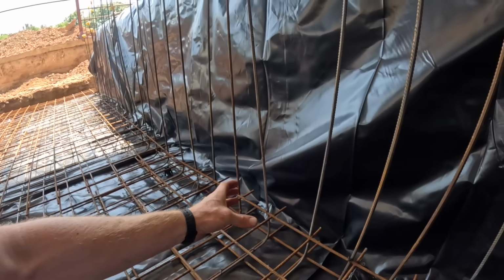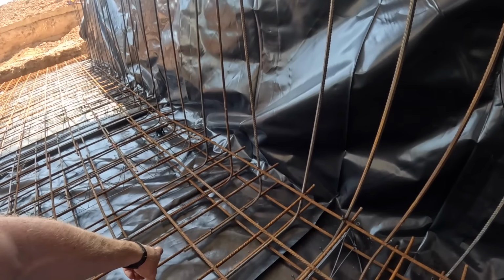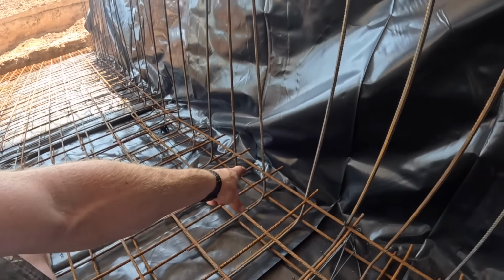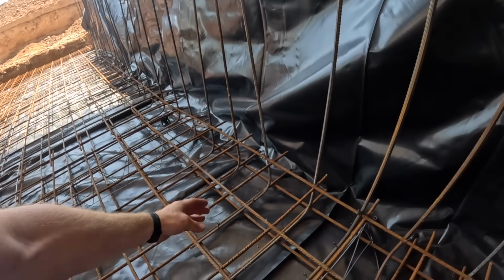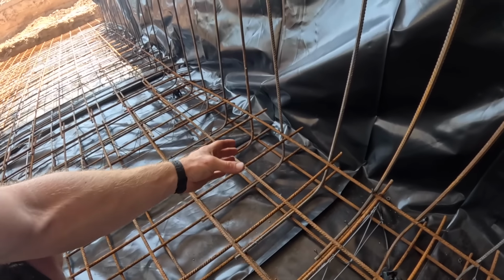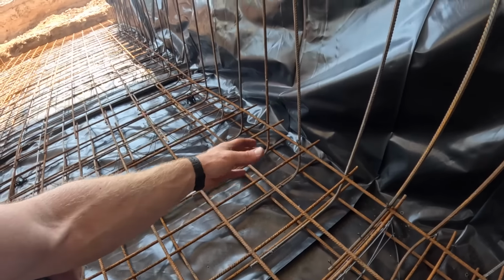Every 200 mil, we need to have an L steel bent. So it's tied at the bottom there, comes up, and then carries up all the way through the blockwork. Because all of our mesh spacings are at 200 mil, that gives us a nice guide to go off. They don't line up perfectly, so we're using the bottom one, so it's tied to that.